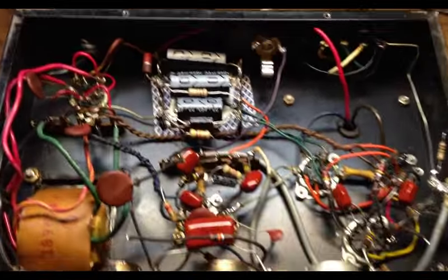And also over here they also have caps to the actual center tap here and here, which is unusual. You don't see that on other amps that I recall. I mean, here's just one other example. This is something I've just kind of been comparing things to, and you see here this one has a center tap on the 6-volt winding, but even over here you don't see those caps from each side of this secondary to the center tap ground. You just don't see that, so that's different.